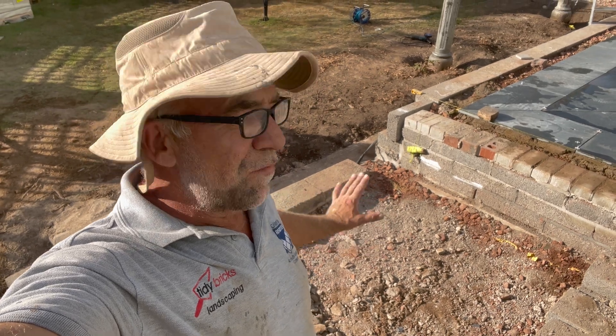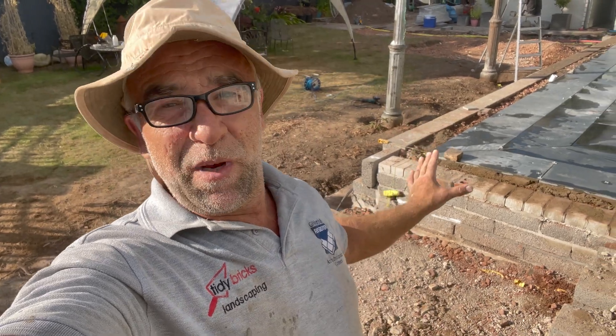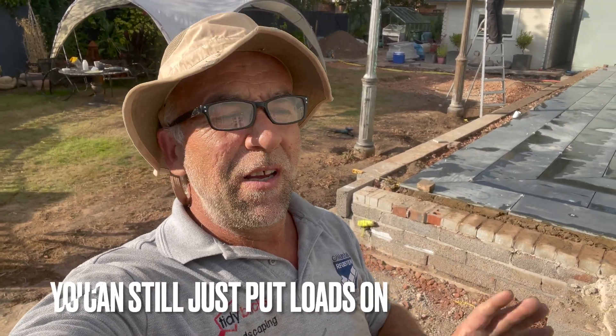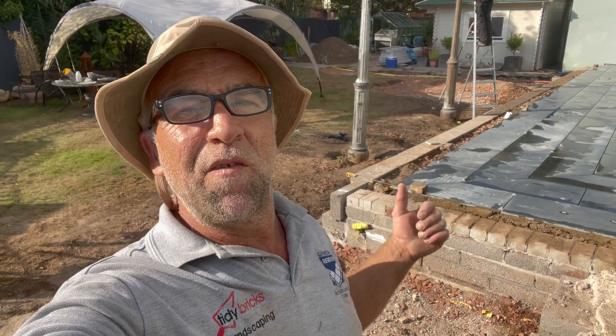I've cleaned everything up now, removed it all. So the moral of this story: I did a semi-dry mix before on a patio which I had to take up due to color issues, but I used the primer — I brushed it on — and it did pop up really easily with virtually no cement stuck to the primer at all. So if you lather it on thick, semi-dry is fine. Wet is fine, if not better. But lather the primer on nice and thick. Don't use a roller or a brush because it doesn't really do much. Get loads of primer, put it on nice and thick — happy days. See you next time.